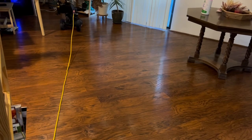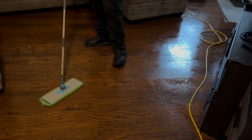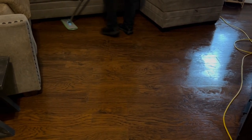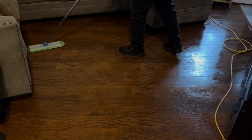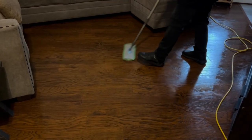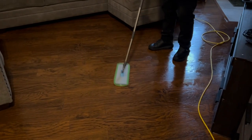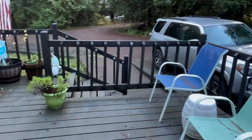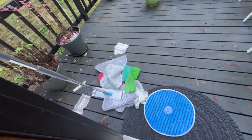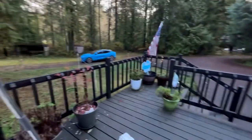Then I flat mop to get more moisture out. Once we get all the moisture up, we can do what's called a dry polish. This is the trick: if you're doing wood or any hard surface floors and you want them to shine without putting on an acrylic, laminator plus, or any polishes, if you just go through with your white cotton pad and buff it out that way it's going to look dull and hazy. But if you get it dry after you're done extracting, then let it dry and proceed.